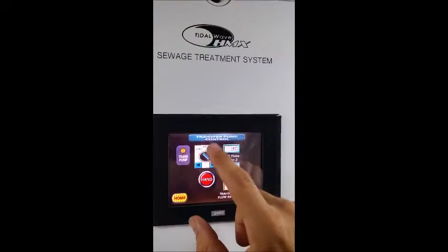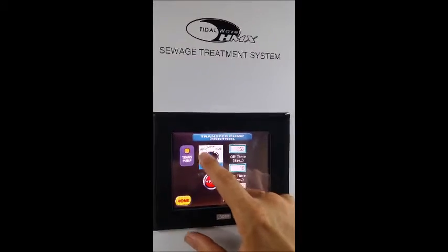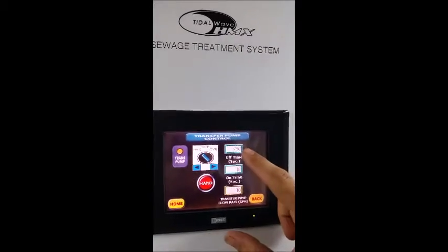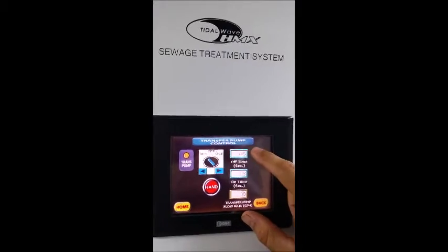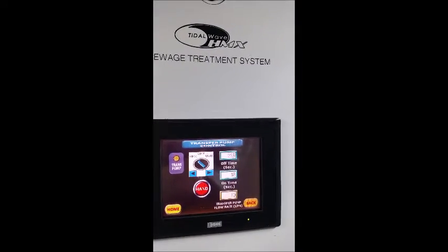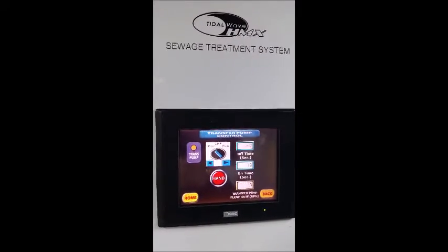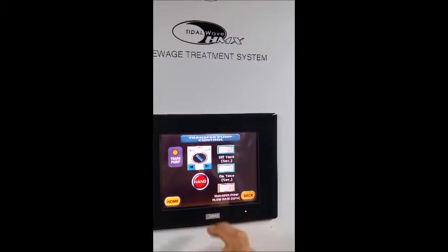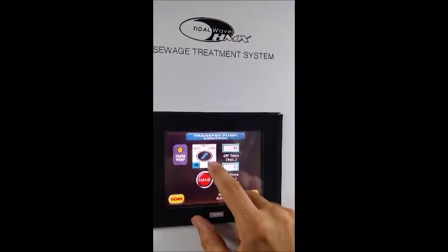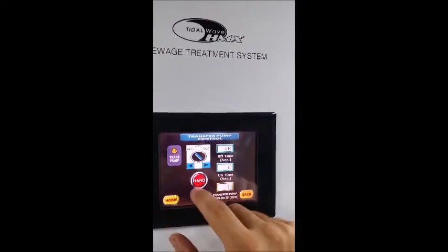This switch is extremely important — it needs to correspond with the three-way valve on your black water transfer pump. When you have this switch set to HMX, you're not necessarily going to see the holding tank pump running right away. What you're going to see is the transfer timer counting down. Once the transfer timer counts down it's going to run your pump for a preset amount of time. The purpose of this timer is to slow down your black water transfer pump to 600 gallons per day and spread that 600 gallons per day over the course of 24 hours. If you wanted to pump directly overboard, you would first switch the valves on your three-way valve to overboard, then switch this to the overboard setting — you'll get a warning screen to make sure you line up the valve. We don't want to do that right now because that's illegal. So we'll switch it back to HMX.